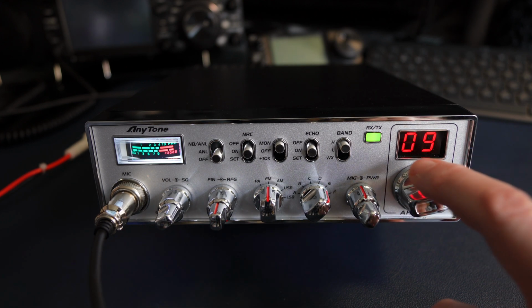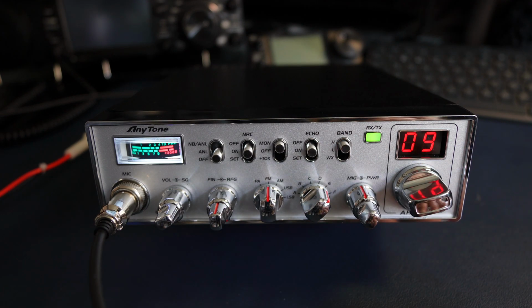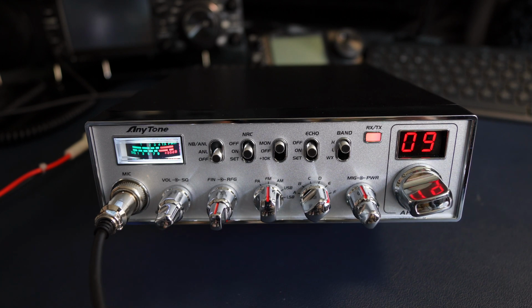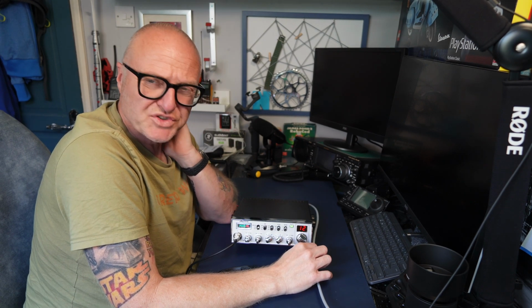Another thing to mention, as you can see there, we're on channel 9. I'm going through a dummy load, so don't worry about that. Everyone's not listening to me, that's for sure. As you can see, when you TX, we see the SWR on the display, 1 to 1. So that's impressive.